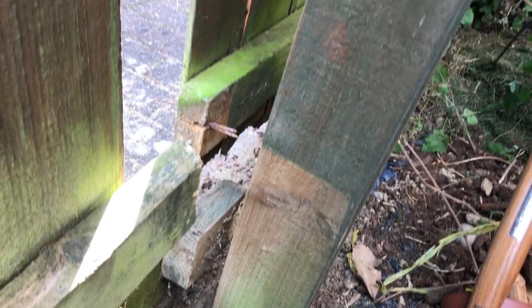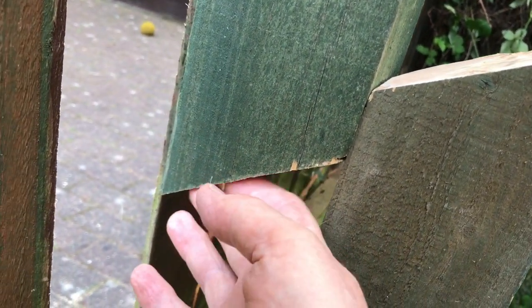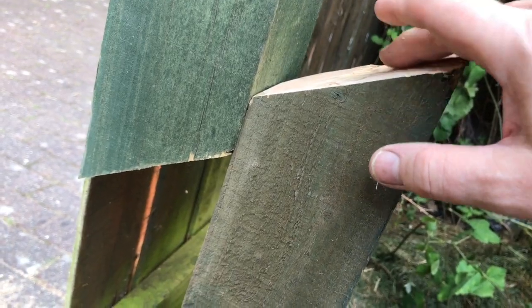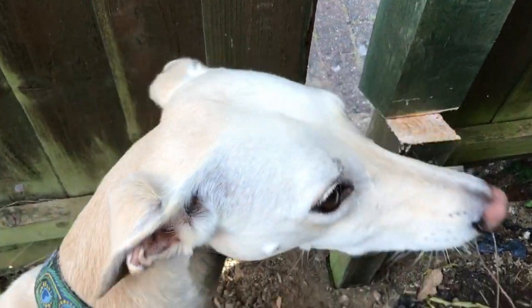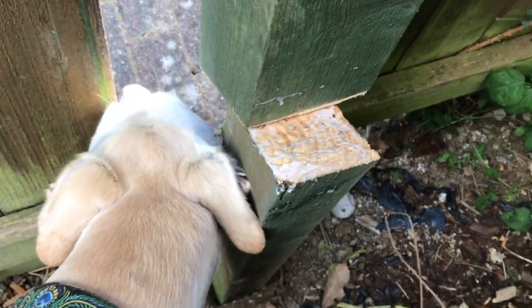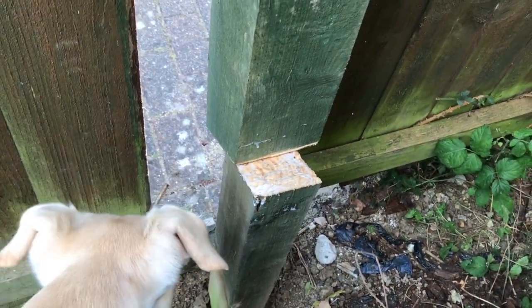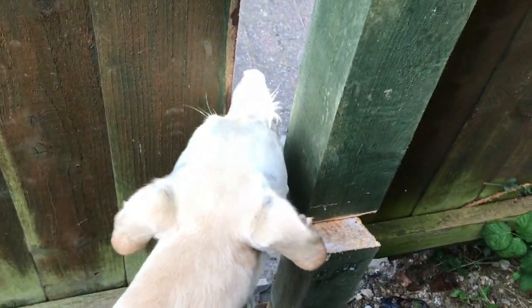I'm going to put the real post in. We have the post nearly in at the top. Now I'm going to put a load of wood glue on this surface. I'll put some on there too so that when they go together there's wood glue between them. Here's Skippy taking advantage of the gap in the fence! As you can see we're really close — the two pieces are lining up really nicely. Once they do I'll put some screws in and bolt it. It's already a solid fence. I'll just give the neighbour the plank back to fasten onto the other side.